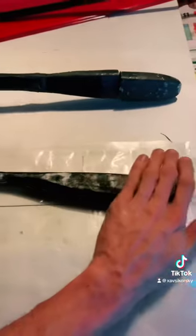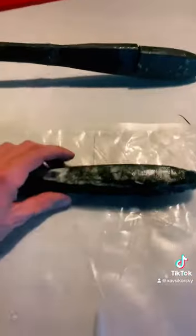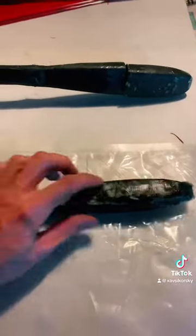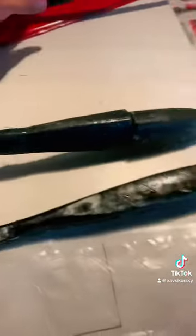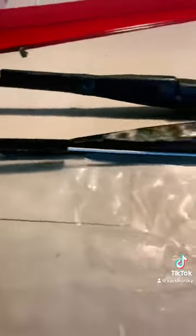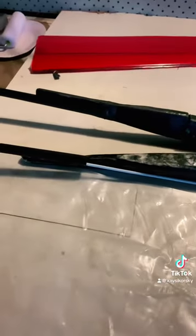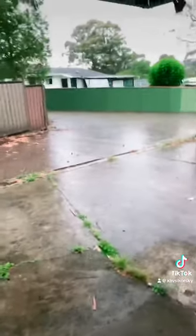Pretty keen I can actually layer some more carbon fiber over the top, re-bag it, let it dry, take that section off, then cut this section out — as you can see where it's black. This section here is open, that's part of the mould, not the actual part that I'm moulding — the actual pod. But this must sit a lot nicer like that, essentially. And then we'll just have a little pod hatch that we'll just slide on.